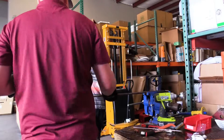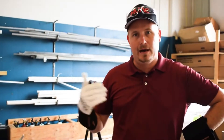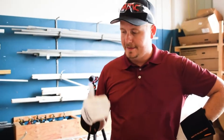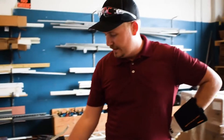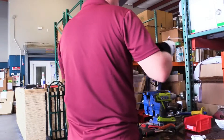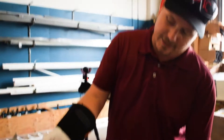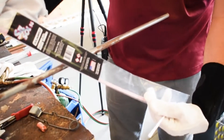You may think — why would I ever braze steel to copper? The answer is you actually run into it more often than you think, because in a lot of cases compressors are actually copper-plated steel. You may find cases where somebody's burned through the copper plating and the solder is no longer sticking. This is how you deal with that: pull back, clean it up really well, and go at it with a 56 rod like this one. This is the packaging for the SilSol 56 from SolderWeld — it's a great product.